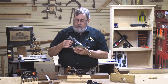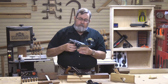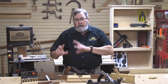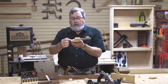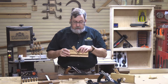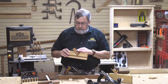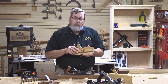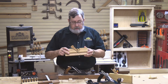To do depth adjustment on my regular metal plane, I use a knob here which does a little lever action to pull the blade up or push it down. In either case, I want a very small amount of blade coming out so I get that nice thin shaving. This other plane is one I built many years ago for squaring up edges — you can see it's got a square cutout, and I used a chisel blade. Just like the rabbiting plane, it's a body, a wedge, and a blade. This pin here, which is just a piece of dowel, performs the same function as the front edge of the slot in that plane — it gives the wedge something to push against. The cutout in it helps me hold it square to the edge of a board when I'm trying to true up that edge. This was my first and so far only attempt at building my own plane.